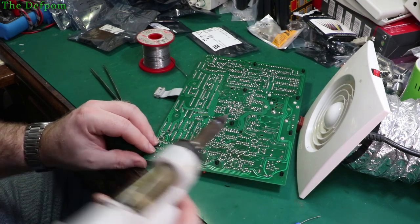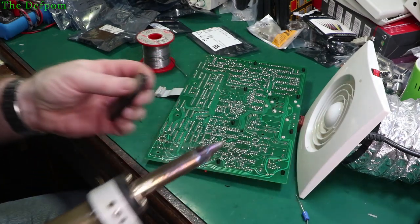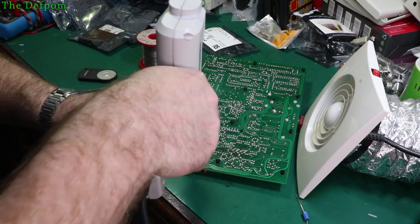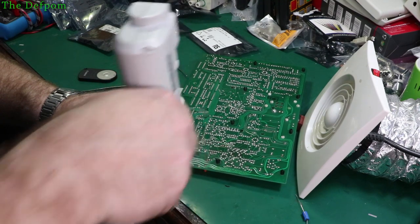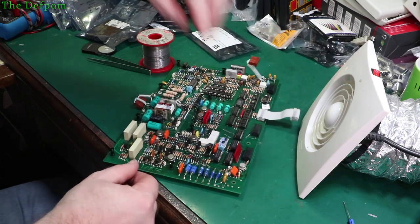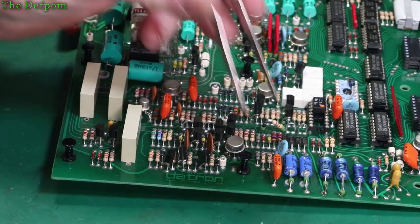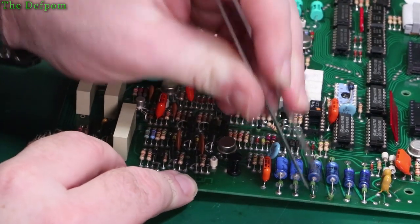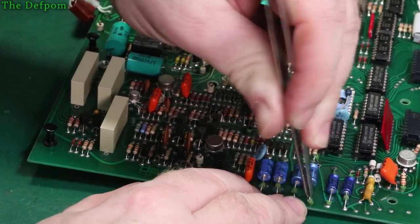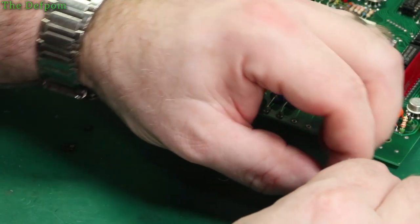It's blocked - I think I left it too long to clean it, it's a bit full. Okay, back to business. So on these capacitors we've got little ferrites or beads on the leads which also have to come off. So there are four little beads - we've got to take those off as well. It's not quite desoldered because the desoldering tip wasn't perfectly clean. They all come off though - one, two, three, four. I've still got them all, haven't lost any.